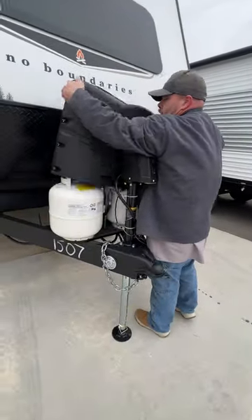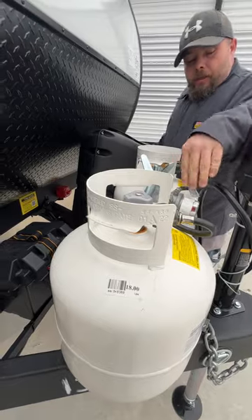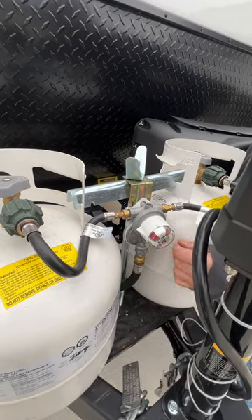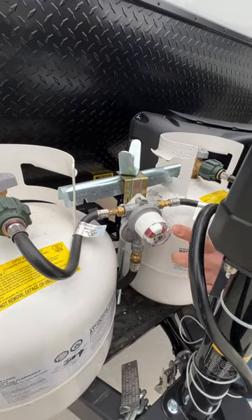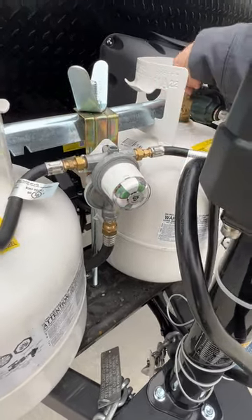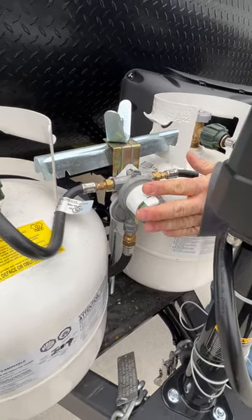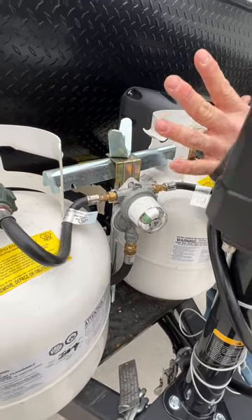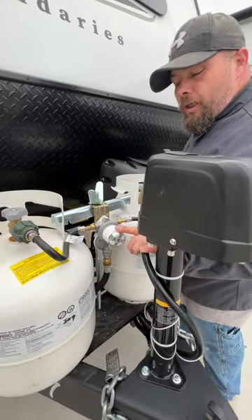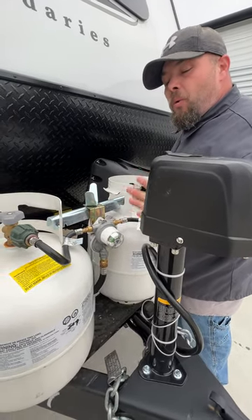Next, we're going to have our propane tanks located right underneath here. They are two 20-pound tanks. This guy here is our regulator — it will tell us which tank we're using. It's got a notch here: right now it reads red, so there is no propane flow. If you turn this on, it goes to green, showing there is propane flow. Once the tank is empty, it turns red. This system is designed so you can have both tanks on — once one is empty, it starts drawing from the other. But you won't know that unless you check the regulator. We usually recommend having one tank on at a time so you know when one is empty.